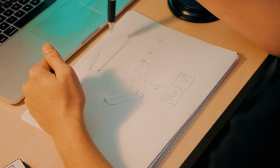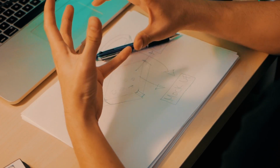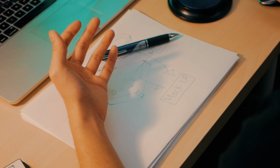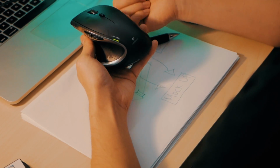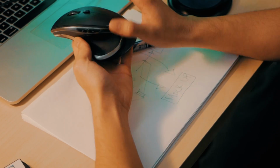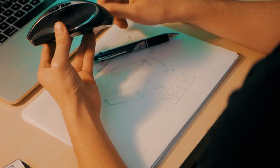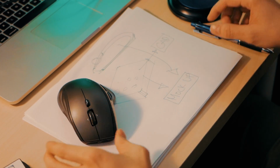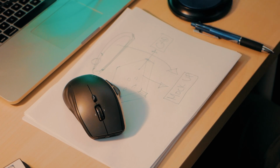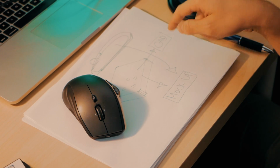Essentially, what you do is you move from this to the mock-up, okay? And the mock-up is a foam model or a clay model, and you make it as closely to your sketches as you want it to be. You're checking it always to make sure it fits the hand well, to make sure the shapes are good and nice and all that good stuff. And so the question is now, how do you get this mock-up into CAD, right? Because that's the next step. So sketch, mock-up, CAD. How do you get it into the CAD?